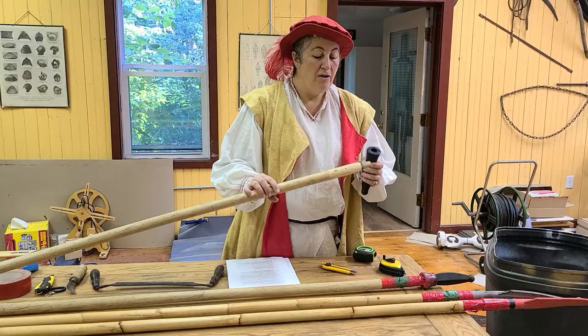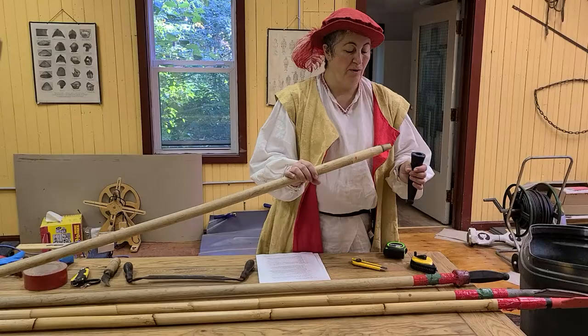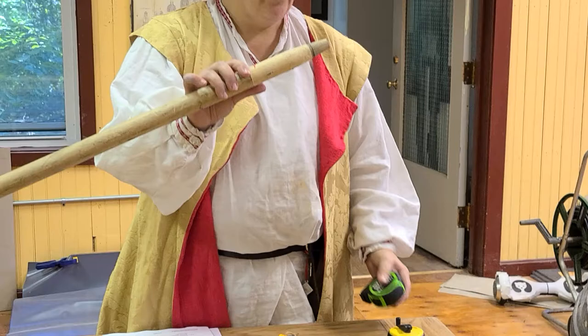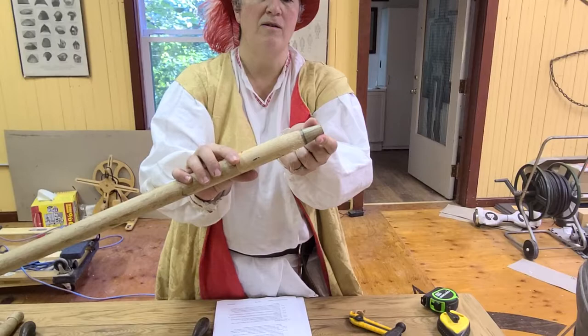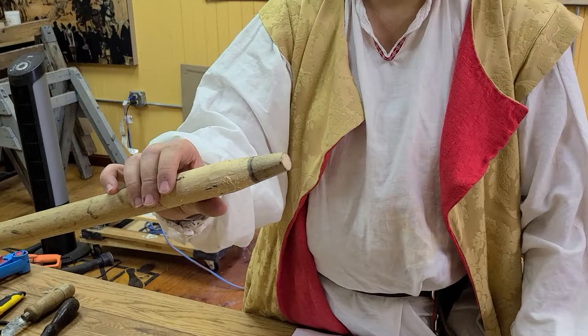This one was one of the first ones that I made back when we were considering even running the experiment. I just took it off in order to make sure that it still meets all of the requirements. And you can see by the color here that it actually doesn't — the original spearhead only went onto it by about an inch and a half, so I'm going to reshape this to meet the rules and I'll show you how to do that. The end needs to be flat or perhaps rounded — it certainly cannot come to a point — and the diameter of the end needs to be at least half an inch. Just to verify with this one, I've got a good three quarters of an inch there, so there's plenty of room for me to taper this down more so that it goes deeper into the head of the spear.